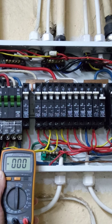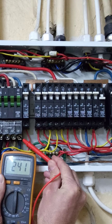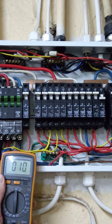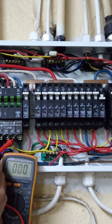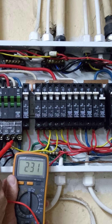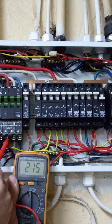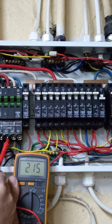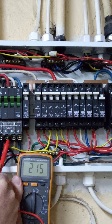The red phase is rather overloaded right now. I do have one water heater running on that phase, but in general the neighborhood overloads that phase a lot as well. Just to show you the comparison: the blue phase at the end there is running at 241, 242, which is very high actually — it's hardly being used. The white phase is running at 231, which is pretty spot on the 230-volt that we like. Now the red phase is only 215. It was actually down to 207 without the water heater on and dropped to about 202-203 with the water heater on, which is starting to become a problem.